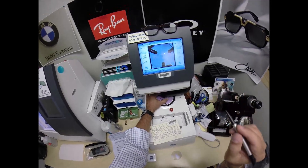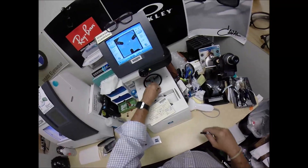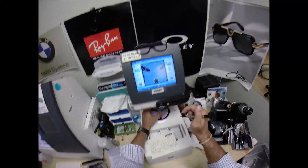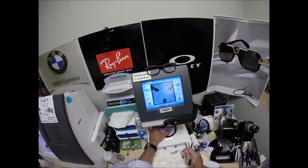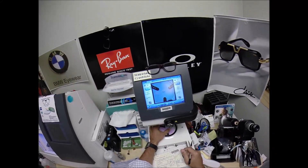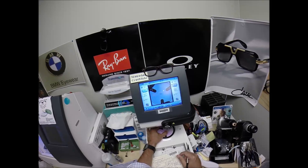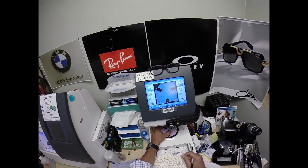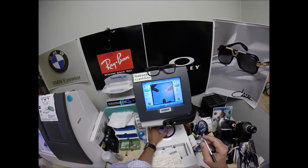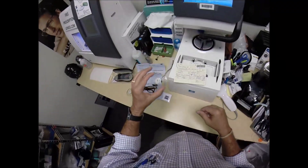The arm is going to come down and place the block onto the right lens. Now we're going to do the same thing for the left lens. Place it on the platform, pull the sticker away, line up the magnet, same optical center height, same PD. There's some dust on there from when I dotted them up, making little tiny black dots and throwing me off from the main component black dots I need to be seeing. Get that laid out and hit that button — the arm is going to come down and place the block onto the left lens.